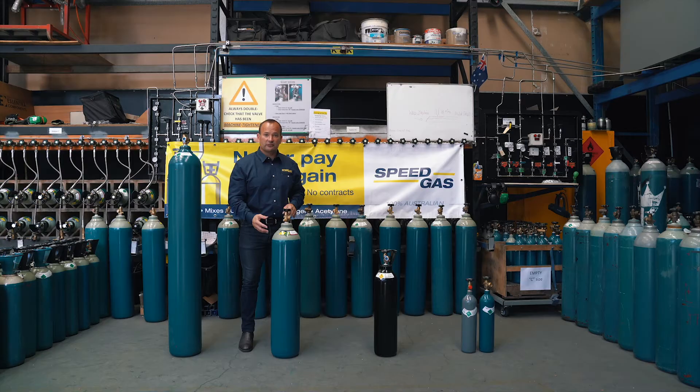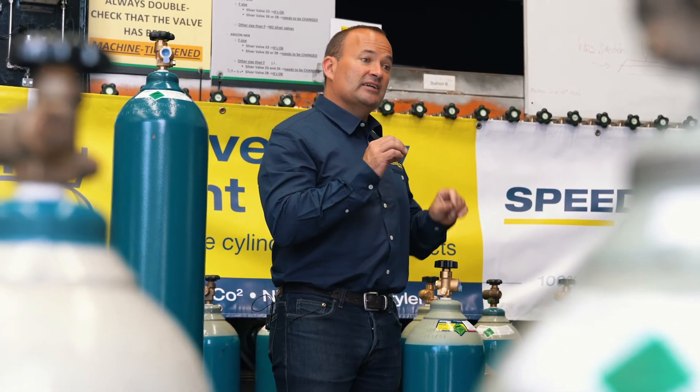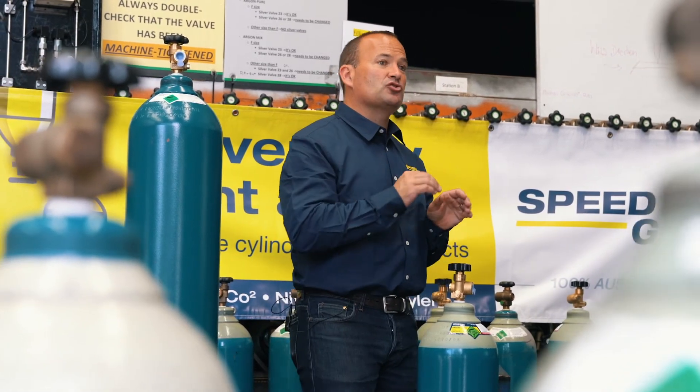The E size cylinder has the shielding gas argon, but it also has other gases inside. The common gases used are oxygen and CO2. Oxygen and CO2 are reactive gases, but in conjunction with argon they can help with arc stability, heat transfer, and also penetration into the weld.